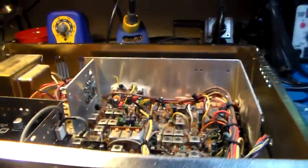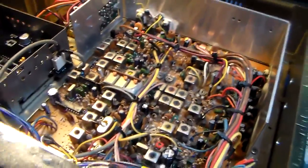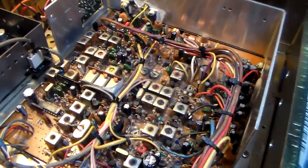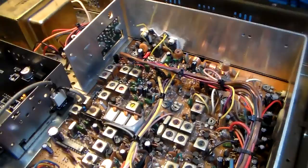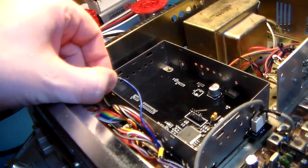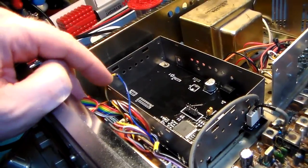It's sort of a window into the radio. You won't be able to see much with the covers on, but still, to fix that bias, this is one of the mods that needed to be done. I had to pull these 2 wires off the board and join them together so that I could detect power on and off, which also does work.